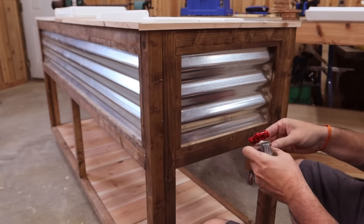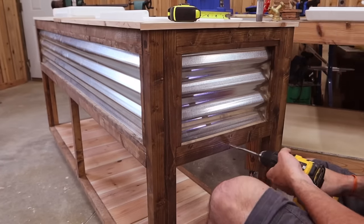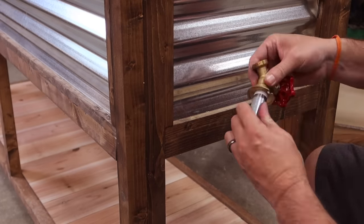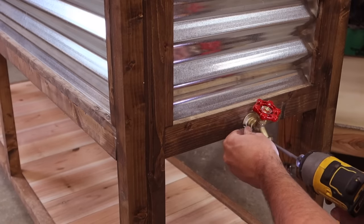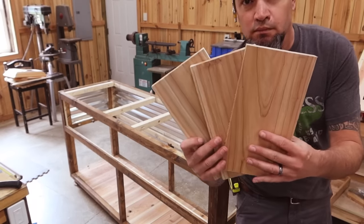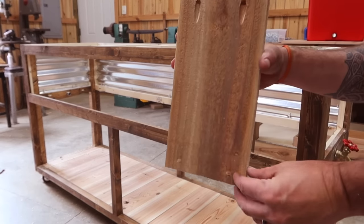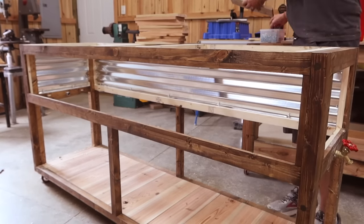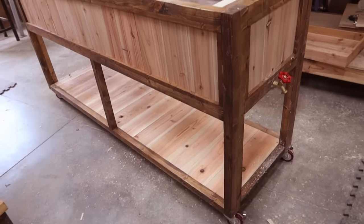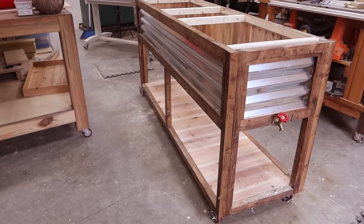So let's go ahead and install our spigots onto our ends or our drains. To do this, I'm going to find the center of my bottom board on the frame, and then I'm going to drill another seven eighths hole. And this will fit the three inch nipple that I'm going to be installing. Once the hole is drilled, I'll take my three inch black pipe and attach it to my spigot with some thread tape, screw it into place, and our drain is all set. This is why I did not attach the top yet. I'm going to be showing you what we would do if we wanted to use the wooden sides. These are parts labeled H, and I'm going to be putting two pocket holes in the ends of each board. Basically where our metal would go, these will fit perfectly. And again, the last board that you install — I would custom fit that one as well. And this is what it would look like with all wood. I kind of like it. But I also like the all metal too — just something about the galvanized look, just clean.